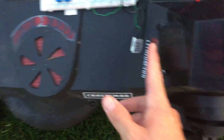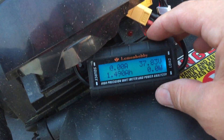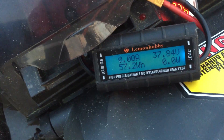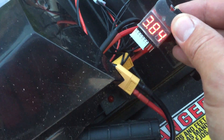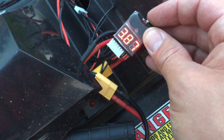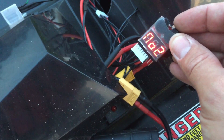All right, it's getting dark out and we're halfway through the lawn. This was really long — I think any mower would have trouble with this. I went over it twice. This baby's not very warm. It runs about either side of four amps as I'm going. I'm only monitoring 5s over here — we're at 3.9 volts on the cells, so halfway or a little more yet to go.